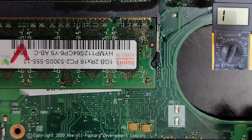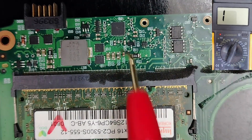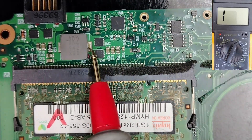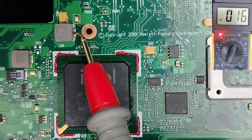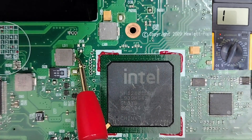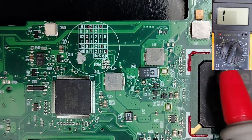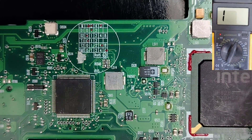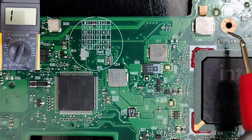Let's check this board. Black probe in the ground. This inductor belongs to the RAM circuit — good. This one good. Here we have 15 — because here we have the ICH, so that's normal. All good, we don't have a short in this board. Now I'll show you a shorted board, but first I'll prove why we get low resistance readings near the CPU.